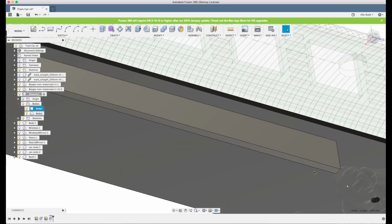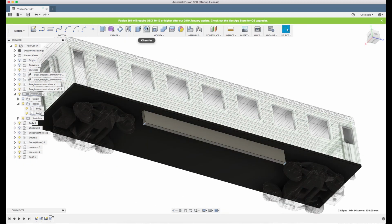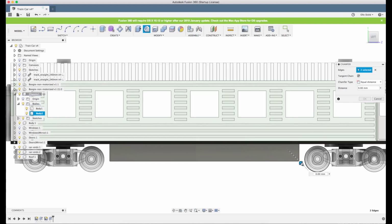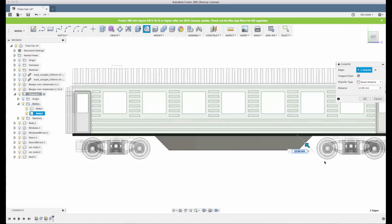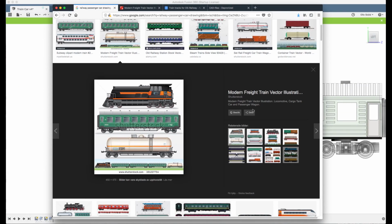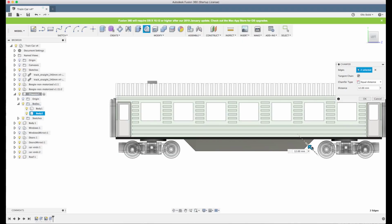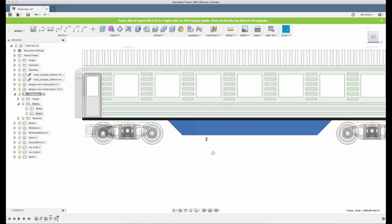So let's see. Let's taper the angles here, or make it with a chamfer tool. Now when you use equal distances, it's just 45 degrees, and we'll use that for now. Let's have a look at the pictures here and see. It looks like 45. It's probably a bit more than 45, but never mind. 45 is good enough. So there we have our starting point, and then we will create some holes in it to make some kind of structure.